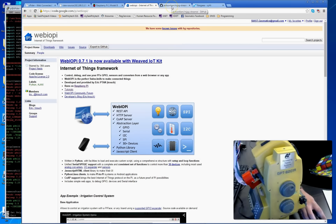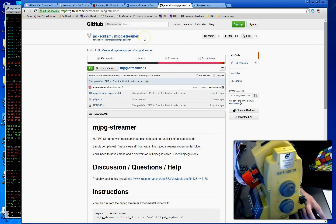Within the software stack, we're also leveraging MJPEG Streamer — specifically an experimental version by Jackson Liam. It's nice because it provides a direct input plugin for the Raspberry Pi camera, accessing the dedicated camera port, which allows us to get a pretty decent video stream. We started with a bare-bones version of Raspistill that just generated images periodically, but couldn't get good frame rates. We're very happy to have found this experimental version of MJPEG Streamer.